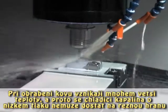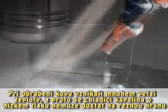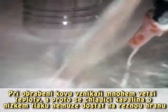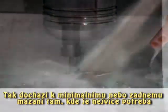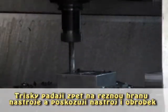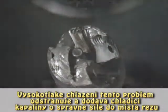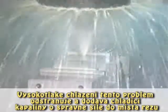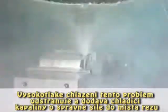The physics of metal cutting create much higher temperatures, and as a result, low pressure coolant just can't penetrate to the tool tip. There is poor or no lubrication where you need it most. Chips fall back into the chip-tool interface, causing damage to the tool and workpiece. High pressure coolant eliminates these problems and gets the proper coolant force to the point where the chip is created.